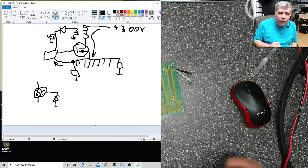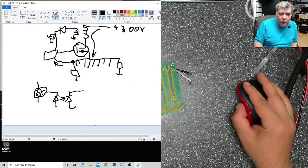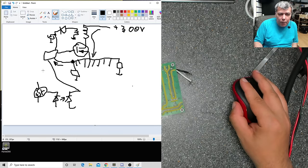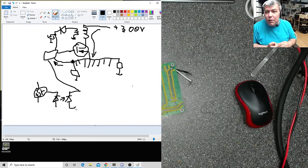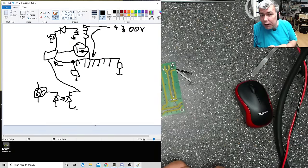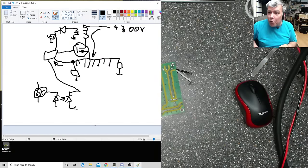And here you have the transmitter, this is the receiver, and obviously this is going to our chip. It's a simple schematic. So even if you think the voltage will be different, it will not be, because it is controlled by that optocoupler. So the optocoupler will solve our problem.